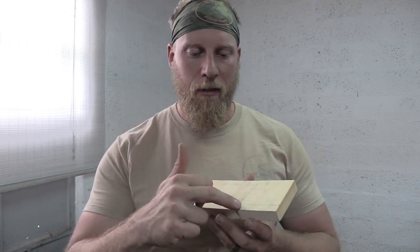With larger items like splitting mauls and splitting axes, you might want to go up to 25 degrees. Gransfors Bruks axes are around 18 degrees — I measured mine at maybe 19 degrees. So depending on the type of axe you have depends on the angle ground on it. And one good thing with this is if you're out in the field using a file and you end up reprofiling, having this along with you can be super helpful to keep getting that correct bevel.